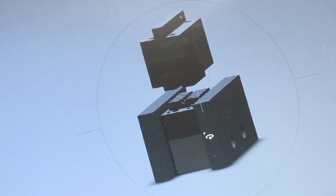They can't set the limits. It just comes down until it finally hits its max 50 ton, and then that's swaged. So that's one of the reasons I think they're having a problem with breaking this thing, is it goes to 50 tons every time. So what I'm going to try and do is maximize the surface area that comes down to contact, so that while it swages, it has enough surface area around it that it takes some of that force.